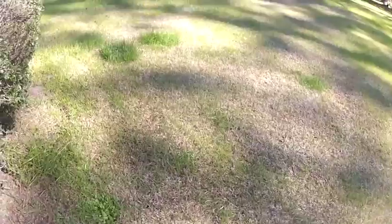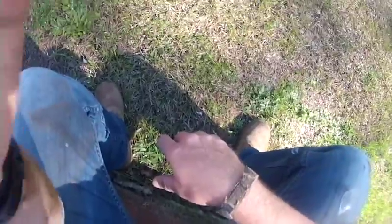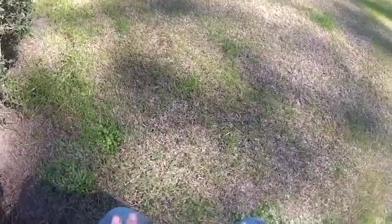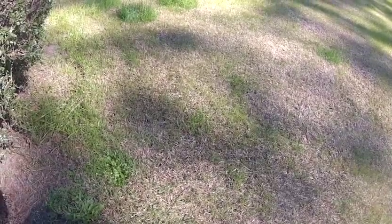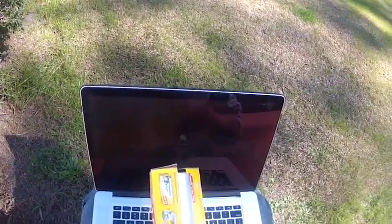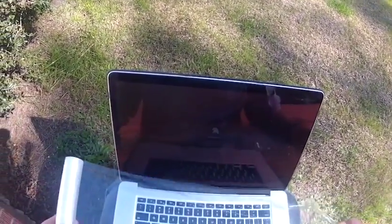Alright, Tabor City home here. Today we're going to work a little bit on the backhoe. One of the things the gentleman at the New Holland shop said was that the screen at the bottom of this crankcase could be plugged up. So in order to check that, we're going to take out this USB fiber optic camera that we bought and see if we can get it down into the bottom of the crankcase and get a look at it.